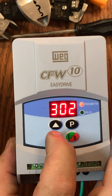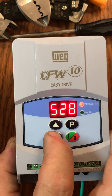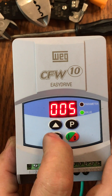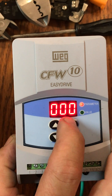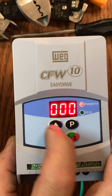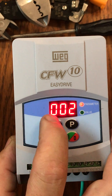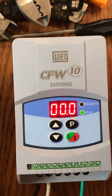We're going to go all the way back down to 000, where we started. We're going to move that back to where we had our 5 for programming mode, then move that back down to 0 to take us out of programming mode. To watch things change when we turn on our machine, we're going to move the parameter to 002, then push value — you should see 0000 on your screen. We're ready to turn on the switch and see how the motor powers up.